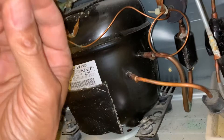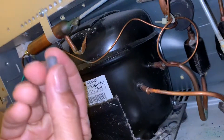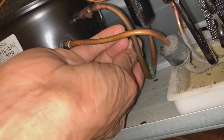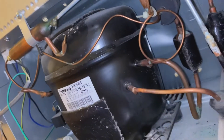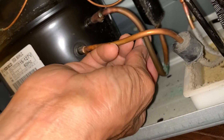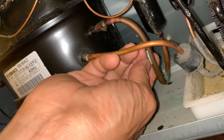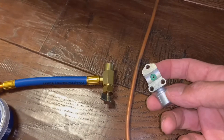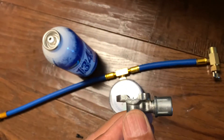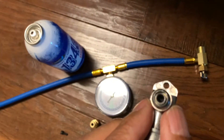We're going to put our coolant in this pipe. For the adapters, you have to make sure which one will fit. The bigger one is a bit loose, but the smaller one is a much more snug fit. Next, we'll need to file the oxide off the pipe with a piece of sandpaper, and we want to position the valve so we can access it. Make sure that spike is wound back before installing by using the allen key.